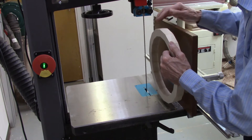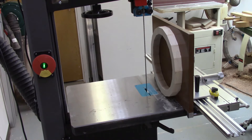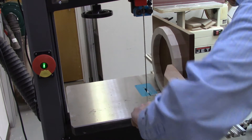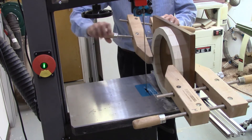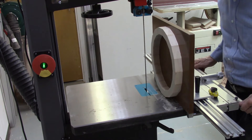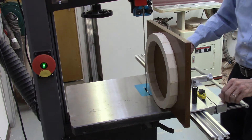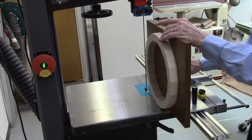I have a 12-inch diameter segmented disc, which is pretty much the full height capacity of my bandsaw. You can clamp it temporarily — just a couple of clamps to set the tape. I removed the clamps, set the system for my initial cut, cut off a piece of waste to square off everything, lock the system in place, and then cut off a sacrificial piece of wood to square off the board.